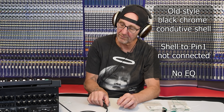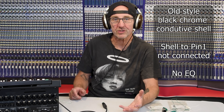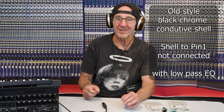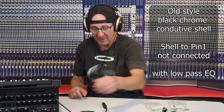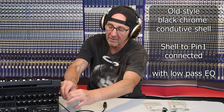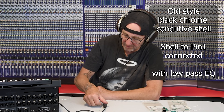You can hear the microphone cable. Not a lot's going on there. Now we can hear a lot of hiss, so I've put an EQ where I've boosted everything below 100 Hz and cut everything above 100 Hz, so we can focus on just the low frequencies. You can hear that slight hum coming in. Now let's connect up the shell wires — the shell will be connected to pin one on both sides, which normally happens on the microphone or whatever piece of gear it's plugged into. Now we're silent.